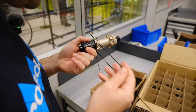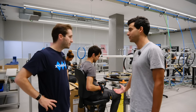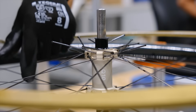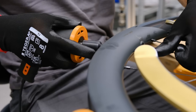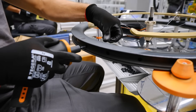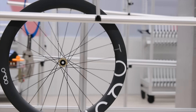Christmas is coming, Liam. The guys will help because we have to finish filming today — I was taking too long, basically. First, we assembled the hubs with the spokes, and then we come here to mounting into the rim, with semi-automatic tools that help the operator to build the full wheel structure and also to have the first tension part of the process.